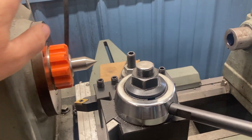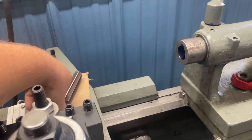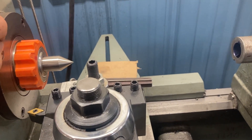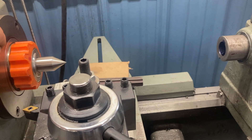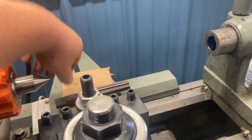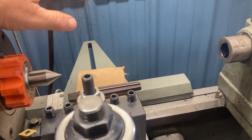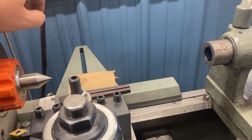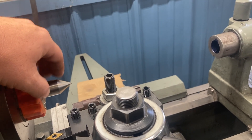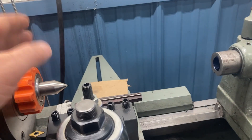I want to give a few comments about how to do this, because I've seen some other techniques where people are just putting the reamer in a chuck — sometimes a three-jaw or four-jaw — and turning under power. I do not recommend power reaming this using the headstock, because you're not gonna have a hand feel to see what you're taking off. It's going to be a very crude process. You want to be supporting it with a dead center in the spindle — you want this to be as true as possible to the machine.